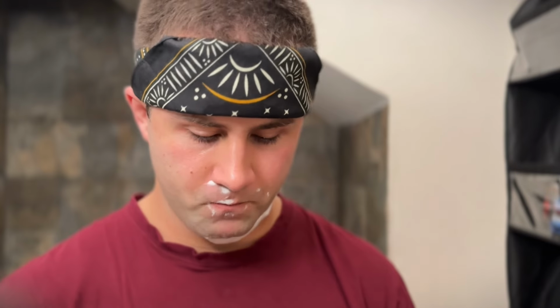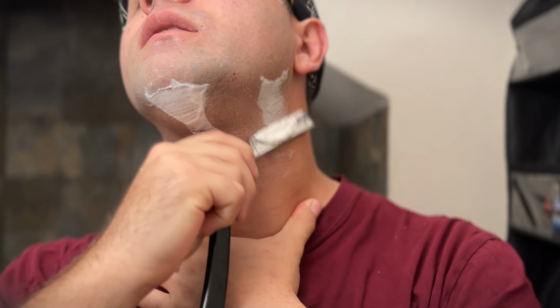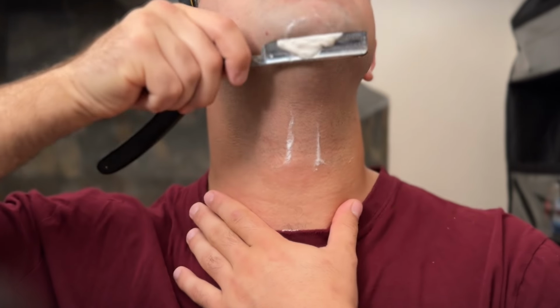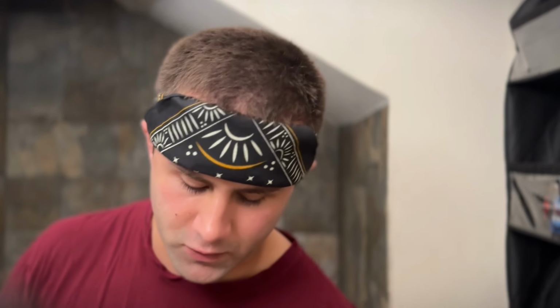So now that I know I can set a bevel on those stones, the slow one and the fast one, I think I'm gonna take it easier now and go back to my normal routine of using my synthetic stones for the bevel setting. Beautiful. For the bevel setting and possibly 5K, I'll do the 5K work and then jump to a coticule. That way I don't have to use as much slurry. Maybe a light misty slurry will get the job done.